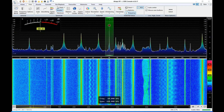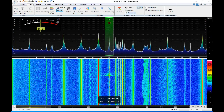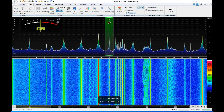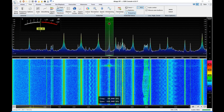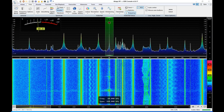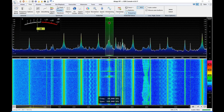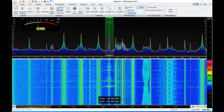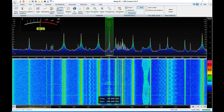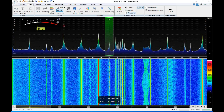I'm not coupled tightly enough into this loop, because there is no increase in the noise floor when I connect the loop to the receiver. Anyway, the reason we're here is I wanted to show you the effect of the common mode choke on a loop antenna. There were a couple of comments about the E-field probe being a very high input impedance and more susceptible to currents on a coax — and that's absolutely true — but I didn't want people to think that there was no benefit if you're running a loop antenna.